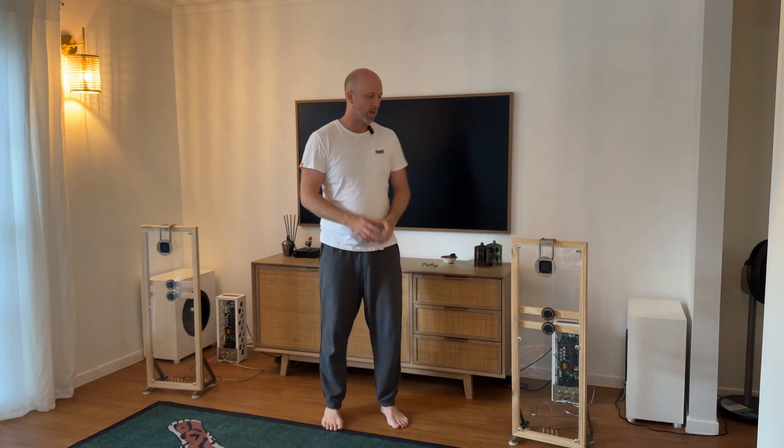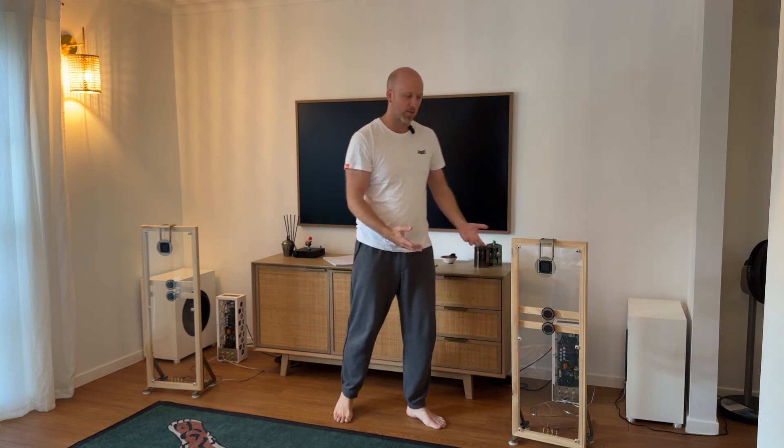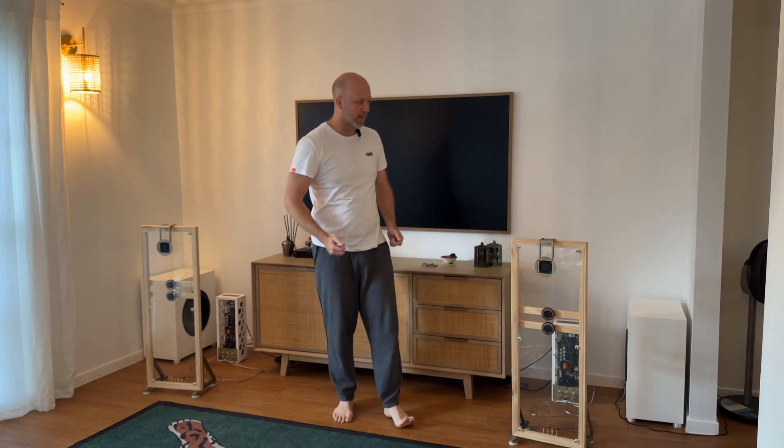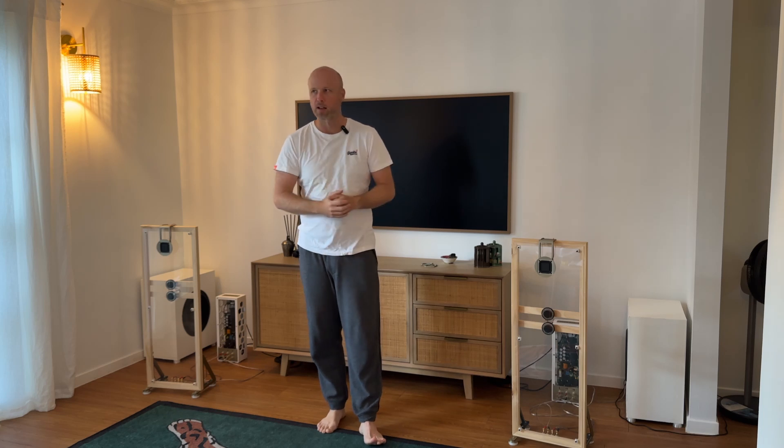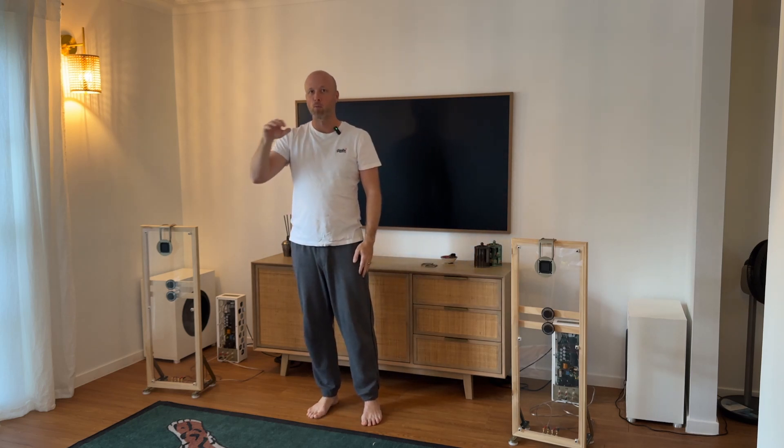My primary concern when I was placing those drivers — well, there's two things. One, I've got this big wood frame and it has to go on that frame somehow because the frame holds everything together, so it needed to go around the frame somewhere. The second, and probably more important thing, is that it should be somewhere around ear level. High-frequency sound tends to fall off quite quickly when you're off axis, so if your tweeter's here and your ears are down here, you're hearing the sound coming off that driver on an angle, which is probably going to be weaker than the direct sound.